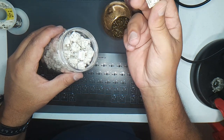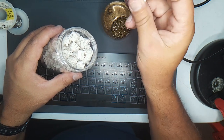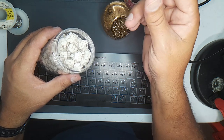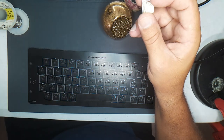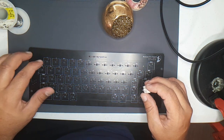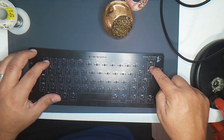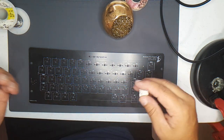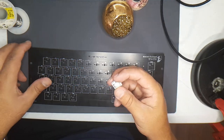They're 5-point switches, or, you know, 5-pin switches are called, even though really there are 2 contacts. And the rest are just alignment pins. And so let's start. What I think I want to do is solder one here, solder one here, solder one here, solder one here, and then turn it around and just solder all of them together. Let's see if I can do that. So.